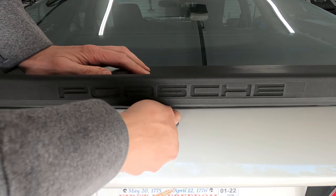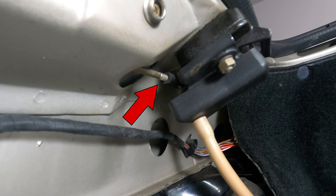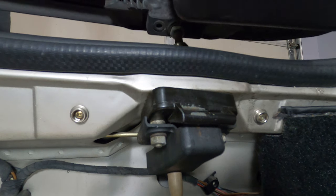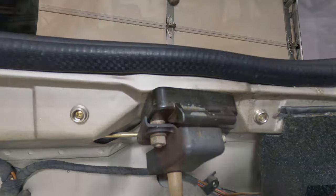When the key is turned, the primary locking component actuates two metal rods, one for each pin receiver. The rods connect to ball joints that pull the two locking arms apart inside each hatch pin receiver. These arms close around the hatch pins to lock them in place, and when the hatch lock mechanism is actuated, the arms open to release the hatch pins.